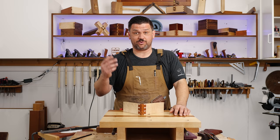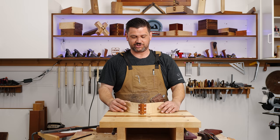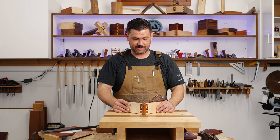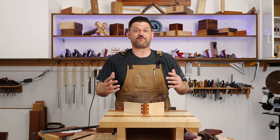Wow guys, that came out amazing. I really like the look of the one we did last week, but you guys were right — I was lazy, I should have put some way to reinforce that miter, and I think we've rectified it. The inlay looks so cool, and the ebony is such a cool design feature. When you look down from the top it really adds a great decoration. You could make the spline proud to support a lid with a shadow line, or make it a lidless box for a coffee table decoration. It has a very Aztec look. I love the lacewood, maple, and purple heart together — they're just great contrast to each other. This is what Joint of the Week is about: we learned something last week and improved on it this week, making joinery we're proud of.